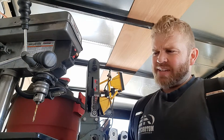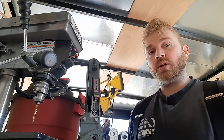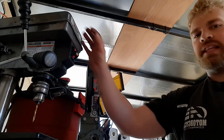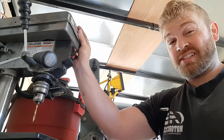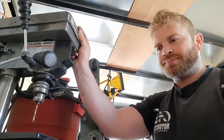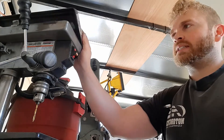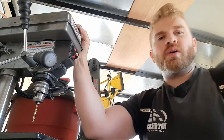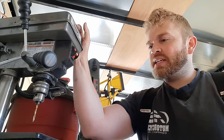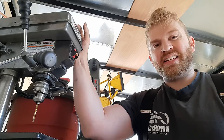I'm not asking a whole lot of it though, because I run it on the slowest speed most of the time — I run it quite slow. I run it fairly gently, because the thing most likely to burn out is the drill bits more than the press. I used to drill out all my knives with a DeWalt hand drill, but if you're making stuff and you're in a position where you can choose between a drill press or a hand drill, in my opinion the drill press works a lot easier — your holes are going to be a lot straighter and it takes a lot of the danger factor out.